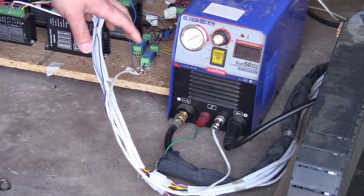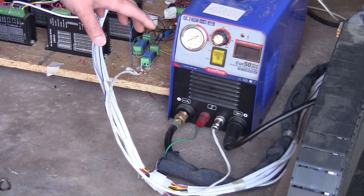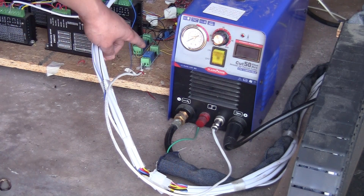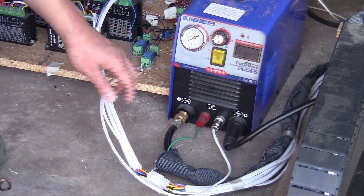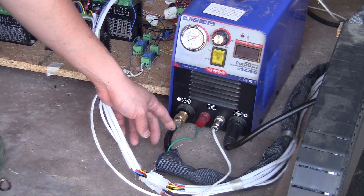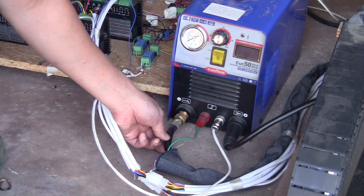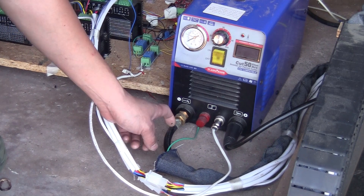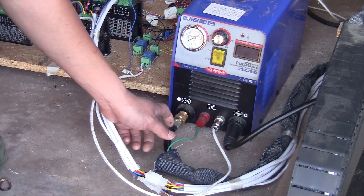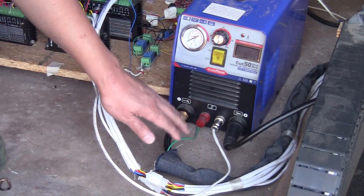The second tip, which I already showed in my previous video: you should connect the trigger wire directly from the connector to a relay, and that relay will be controlled by the output of your controller board. That way, the trigger wire will be kept far away from the pilot arc wire that carries a high frequency signal, and also from the wire inside the torch tube that conducts the current for the arc — because when the arc is igniting, it may also induce some interference. The best way is to keep these wires as far apart as possible.